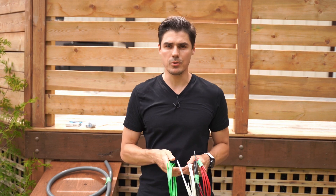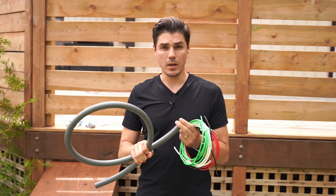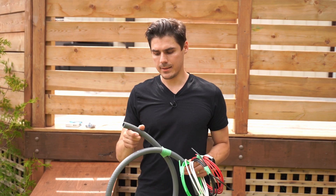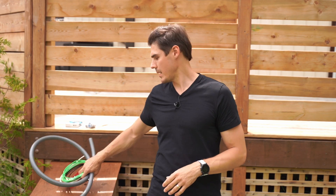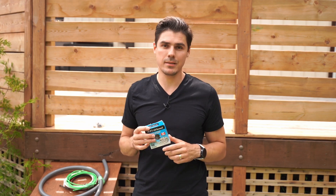I put the wires through a three-quarter inch flexible conduit, which is really easy to run through your house, basement, or wherever you need to feed it through. It's flexible, watertight, super safe, and three-quarter inch can take up to six of those wires. For the box connection I used a push-in waterseal simpush connector — very easy to connect to your box. To secure the conduit to the house I used metal strapping, which is way cheaper than buying specifically designed brackets and does the same job. I'll put everything in the description below.